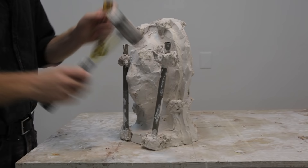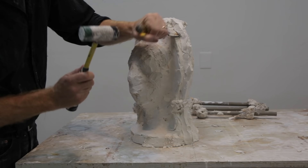At this point, it's best to wait at least an hour to make sure that the poured plaster is sufficiently set inside the mold. Then we can begin to remove the supports, including the supports that hold the two halves of the mold together, and also chiseling away the seam of plaster that was covering the crack of the two halves.